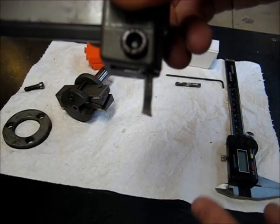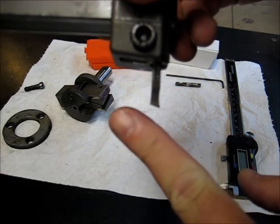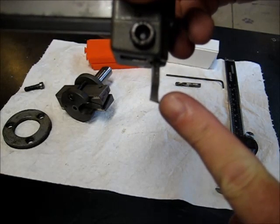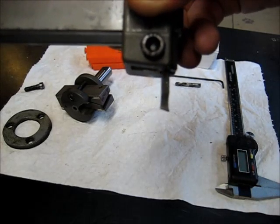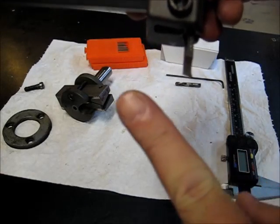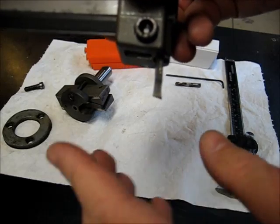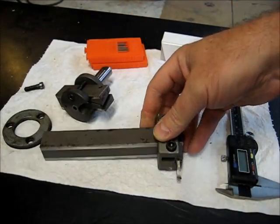And you see this cutter has, see the angle across this face, right? The low end of this cutter edge is on the outside. So this cutter is designed to cut clean holes. And you know this because of the way it angles in. It's going to leave an angled cut surface on the disc that you cut out of the hole.